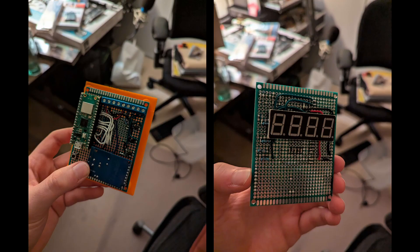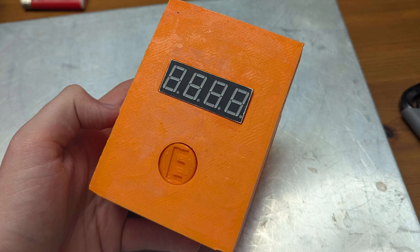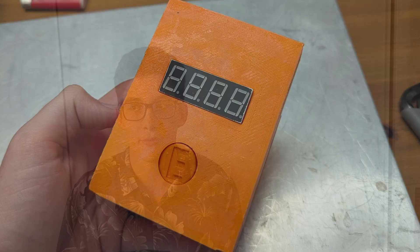For the actual controls of the gun, I soldered up a control board with a Raspberry Pi Pico as the controller and a seven segment display for the score. I'm actually really happy with how this board came out. It's the first time I've used both sides of one of these Vero boards for components, and it's the first time I've designed an enclosure that interfaces with the board — like how the seven segment display sits flush and the e-stop button can be pressed.